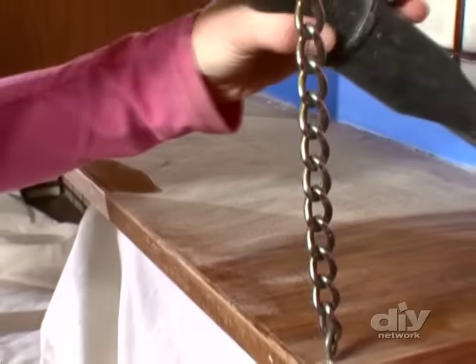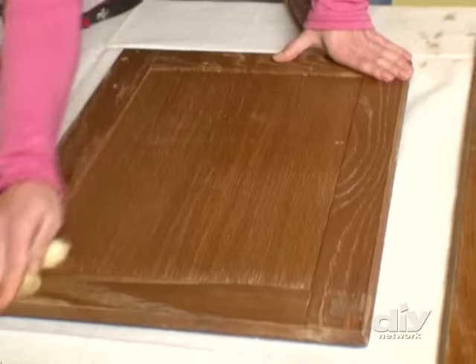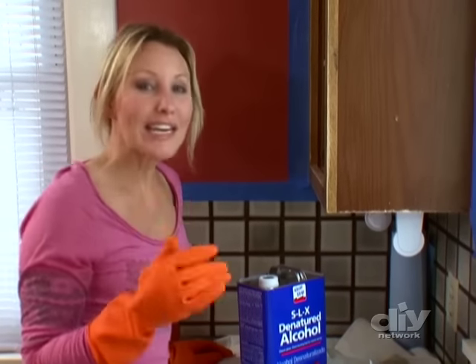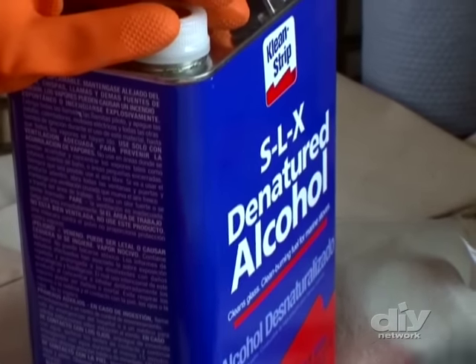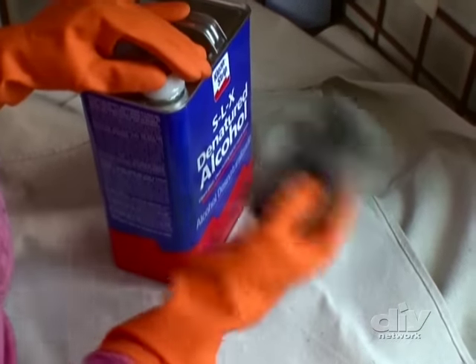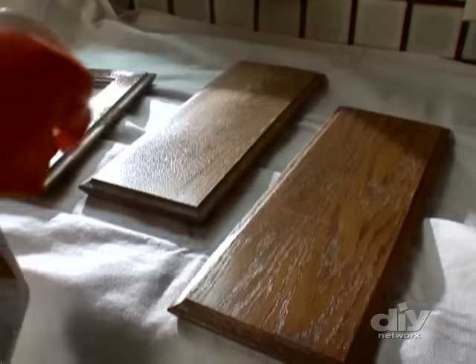Once you get all that sanding done, you need to get rid of the dust before you start painting. Get your vacuum, remove all the dust, then go over it again with a tack cloth to make sure you have a nice smooth finish. A small handheld vacuum or wet-dry vac works great for the cabinets themselves; a pneumatic air compressor works really well for face fronts, especially if you're dealing with crevices or molding details. When you finish prepping, take one final look — if there are stubborn stains, use denatured alcohol to remove them. If you've got a paper veneer that you can't sand, use denatured alcohol with a little steel wool to take down the sheen.